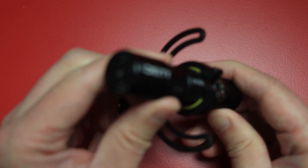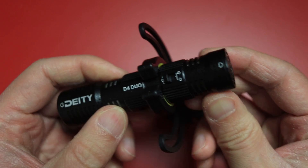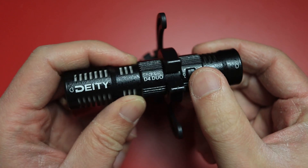While the USB-C to TRRS headphone adapter does transmit some of the audio signal, it's really problematic when you're trying to send a stereo signal from your microphone — like the Deity D4 Duo, which has the ability to separate tracks left and right, or a two-channel wireless receiver that can split receiver one and two to left and right. Those headphone adapters won't allow you to have full functionality. Even though both adapters have a male USB-C end and a female 3.5 millimeter end, they don't function exactly the same.